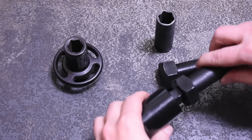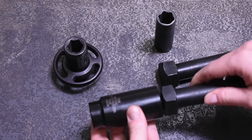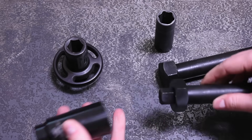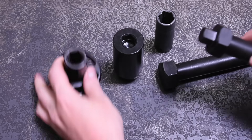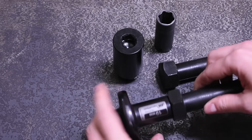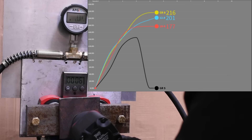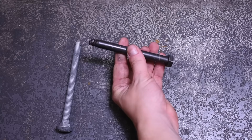This precise fit with small hex size but large threads will allow us to shoot for the moon torque-wise. The problem with testing new 19mm or three-quarter inch head bolts is that they are easy to kill, because a bolt can easily be 1,000 foot-pounds worth of rusted or stuck, but new threads when testing them can't really be tightened to 1,000 foot-pounds at that size.